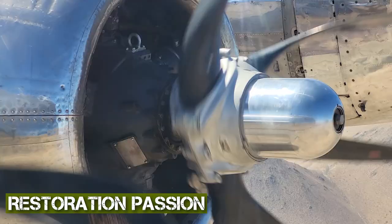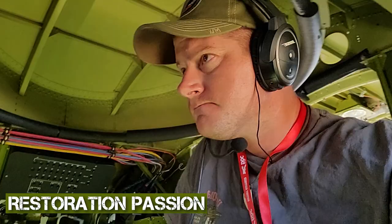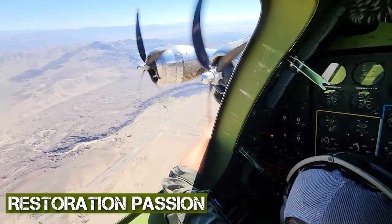That harmonic rumble in the airplane? Yeah. What that's telling you is that the propellers aren't synchronized. They're not all four spinning at the same speed. I've got a sync pack that'll get me close. But if you look out your window, see where that yellow arc is? See where that shadow's passing through there?